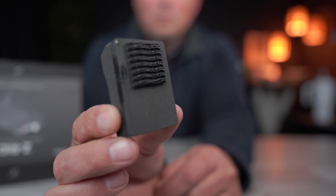The ZRID attaches to your drone with 3M hook and loop. I recommend heating up both your drone and the hook and loop before you attach it, because you want to make sure it has good adhesion. Don't try to attach it on a cold day — just make sure both surfaces are warm.